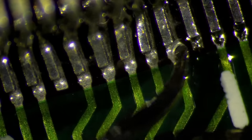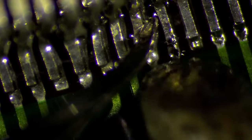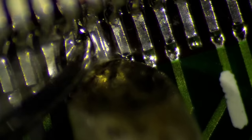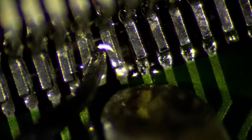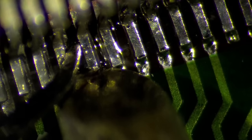You can see how the solder broke here and just the metal pin went away. So if you have something like this on one of the other chips and the leg is not completely disconnected, it looks like the leg is still making contact, but you may still face an issue and the Voodoo card may behave very weird. Sometimes it may not be always the case.